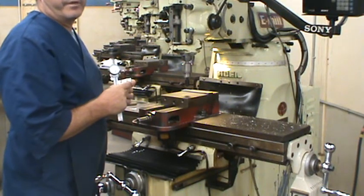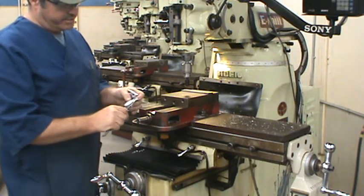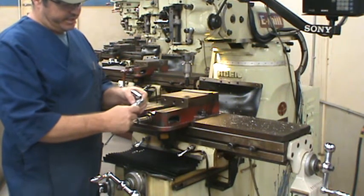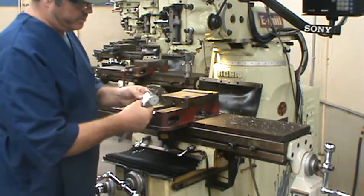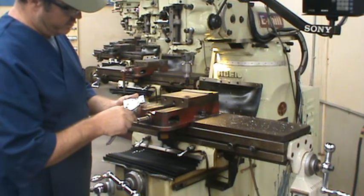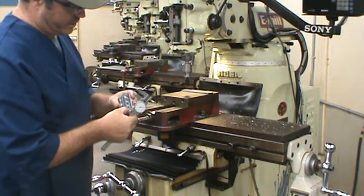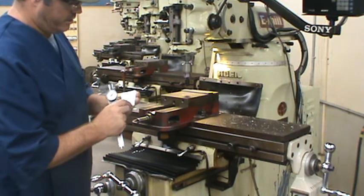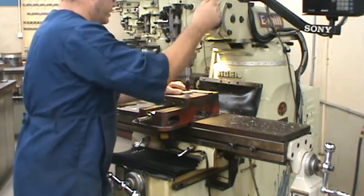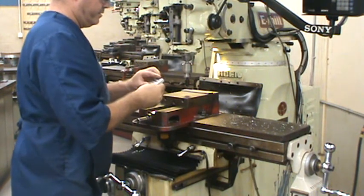I can bring in my caliper to check. I know this is a quarter-inch hole, and the callout for the countersink diameter is 260 to 280 thousandths. I'm going to set my caliper to 270 and lock it. I'll use the inside teeth and visually check it. Even though it's around 260 — a little small — it looks good enough. I'll continue on the remaining holes, just very gently. That looks pretty good.